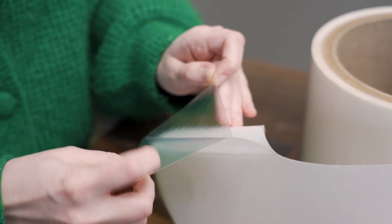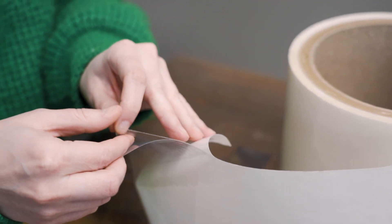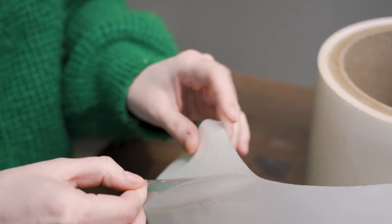So what is the best way to bond to both of these very different substrates? First, you're definitely going to want to look at a differential double coated tape. Differential double coated tape is a solution for bonding two dissimilar substrates together. It consists of a carrier with two different adhesives — typically one side provides a more permanent bond and the other is a less strong adhesive to allow mobile placement or repositioning.